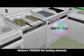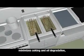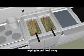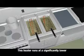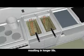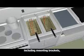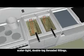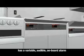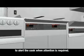Watlow's fire bar flat heating elements are the perfect solution for quick-serve fryers. The fire bar's unique shape minimizes coking and oil degradation while enhancing the flow of oil past the element's surface, helping to pull heat away from the heater's sheath. This heater runs at a significantly lower sheath temperature than an equal watt density round tubular, resulting in longer life. Fire bar heaters come with several options including mounting brackets, watertight bulkheads, and watertight double-leg threaded fittings. The Series N7 custom temperature controller has a variable audible onboard alarm that provides a flexible and practical way to alert the cook when attention is required.